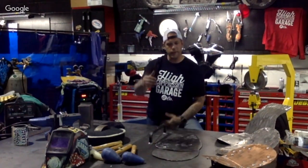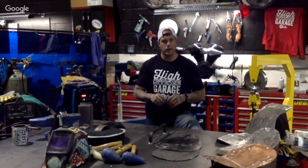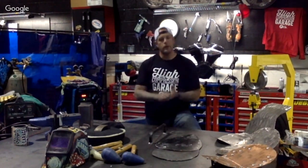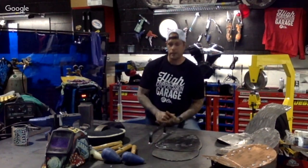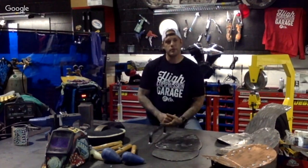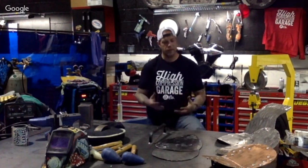And to expand on that, with sissy bars, if you're building those out and you have two bungs on the side that you welded on and said, hey, that's good enough, keep in mind that thing is going to tip right backwards. So you're going to need another area to support that piece, going into a flange or somewhere else on your rear fender, and from there you should have enough strength behind those supports to support anyone in the back behind you, or luggage if you're putting it back there as well. So keep that in mind as you're building or fabricating anything.